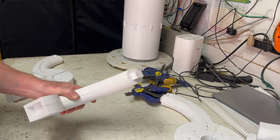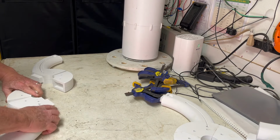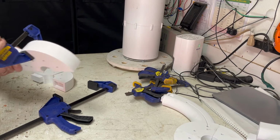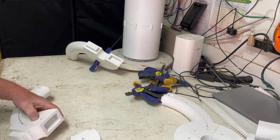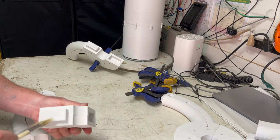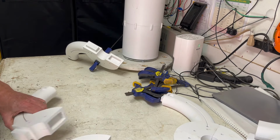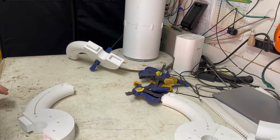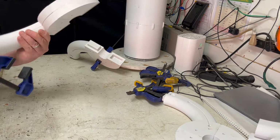Acetone and ASA. Hard to find a better bond. Shoulder blanks mate with full shoulders. We'll attach arms later. Compress the mating surface with a clamp. Oops, not that one. The male end tends to open the insertion point. It must be clamped for strength.